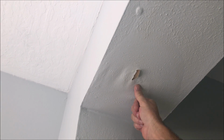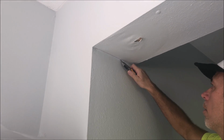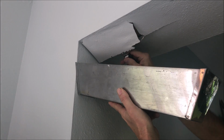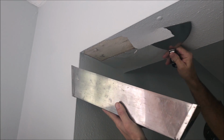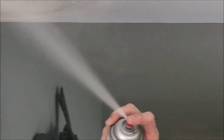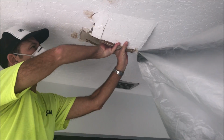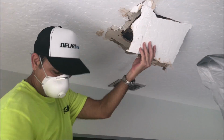And if you missed part 1 of this video series, I showed you how to assess the water damaged drywall ceiling and also the water blister on the wall. I also showed you how to remove the blister by scraping it off from underneath with my 6-inch knife and my mud pan to catch all the debris, and also how to prep it before doing the mud work. And you also got to see how a water damage repair can snowball real quick. I'll leave a link down in the description to part 1 of the video series.